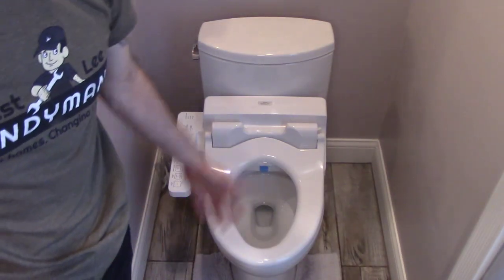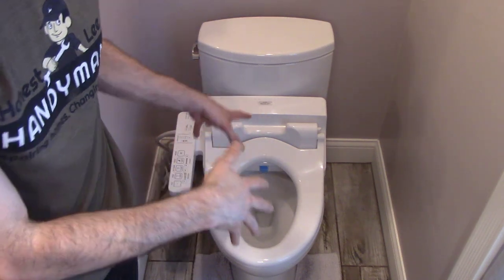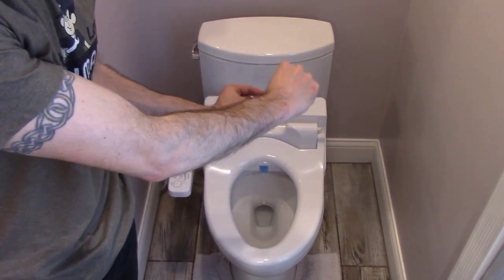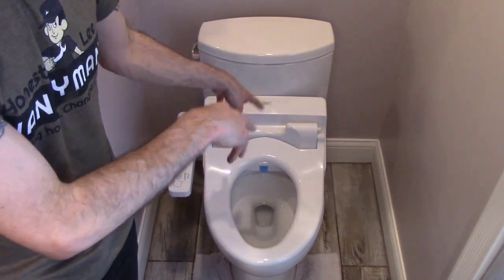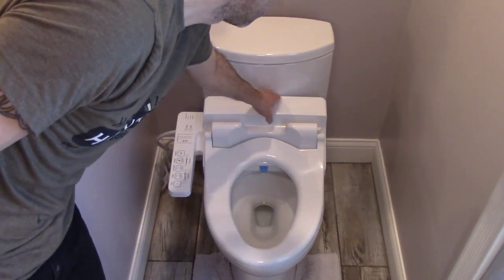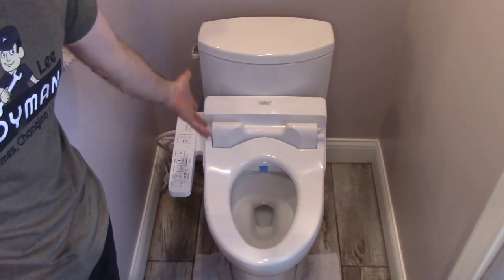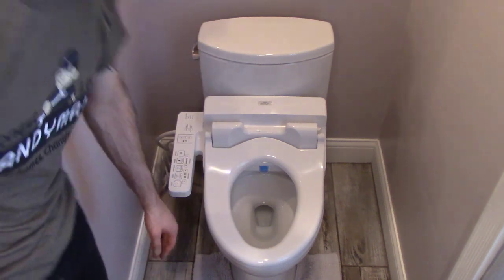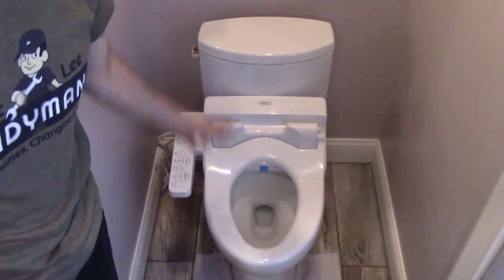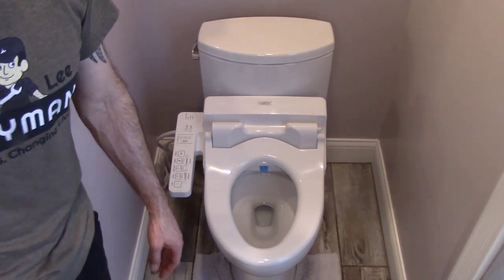Okay, so after a couple rounds of loosening or tightening the screws, pushing it in, checking fitment, pulling it back off, and moving the little screws around, I got it the way I want it. It's basically all the way back to the seat here because this is a small tank. Although this is a Toto toilet, so it's matching brand, so it should work. So it fits pretty well. I'm going to pull it back off and tighten those things down firmly, and then we'll move on.